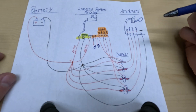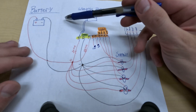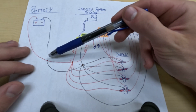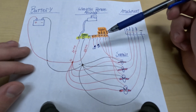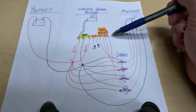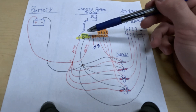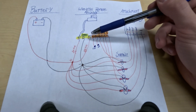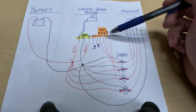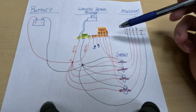Here's a quick explanation of what's going on with the wiring on paper. You start with your battery — you have a basic positive and negative power coming off of there. Then you have your wireless remote receiver, and that has nine wires coming out of it that are all labeled. Wires one through three are your input — power to run your wireless remote — and then four through nine are your output, where you're rerouting your power.